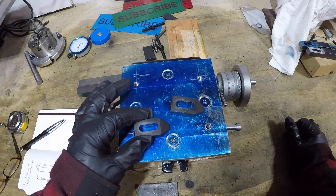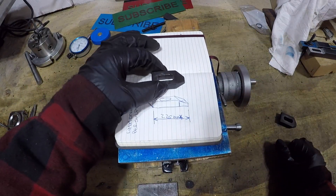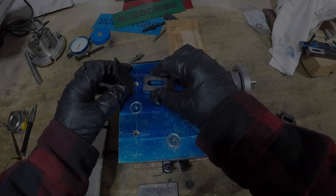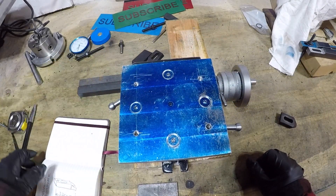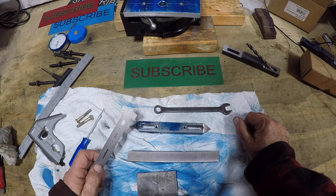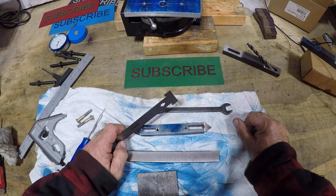Next, I'm going to make a variation of the small clamps. The clamps will be 2-1/4 inches long, will be slotted, but at the back end will have a jack screw. This will eliminate the need for the step block and make it much easier to use. I'm going to machine it as one big block, then cut it to length. It will make it easier to fixture on the mill.